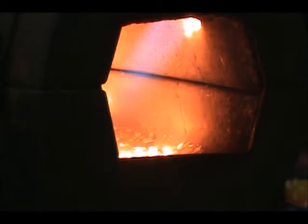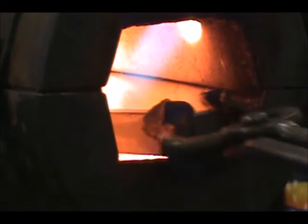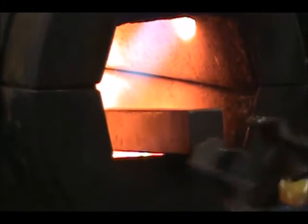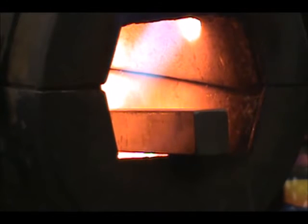Shouldering is one of the core techniques you will use when forging under a power hammer. The dies on a power hammer stay in line with one another, allowing you to make crisp shoulders like you would under a smithing magician, guillotine tool, or fulling set on the anvil. The speed at which a power hammer runs allows you to make this shoulder on a variety of stock and employ as many tricks as you want for this shoulder.